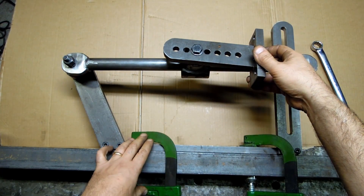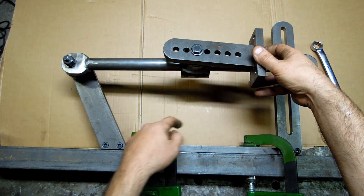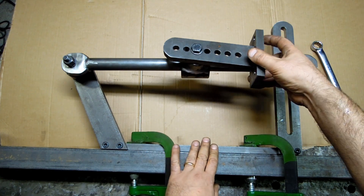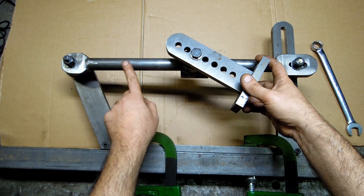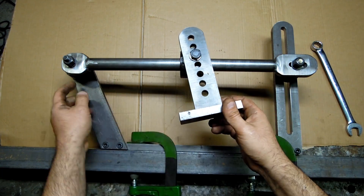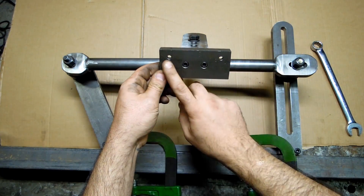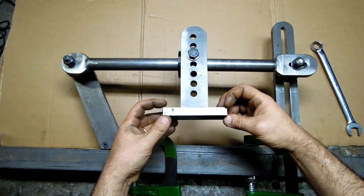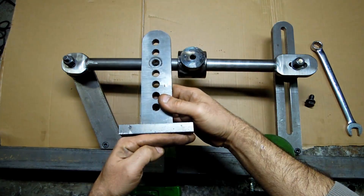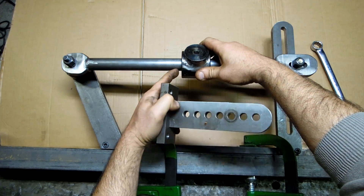What I've done here is just put some C-clamps on a piece of steel on my workbench to mimic the lathe taper attachment bolted into the back of my lathe. This structure would depend on how big your lathe is and where you have your attachment points. The only thing that's really important is that once you have this bolted down, the bar that your cross slide will be following ends up being at the same height as your cross slide. I have some big bushings here that raise this level up to get clearance over the back rails. The back of this bar just has two holes, and I drilled and tapped two holes in the back of my cross slide. So this little tail gets attached directly to the back of my cross slide and is rigid with the cross slide. Through here there's just a small hole so I can get oil down into the bronze bushing.